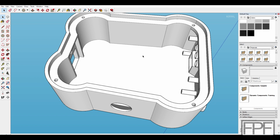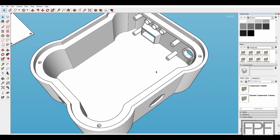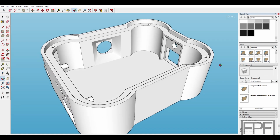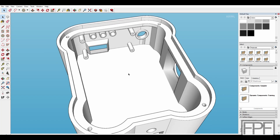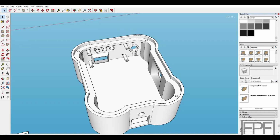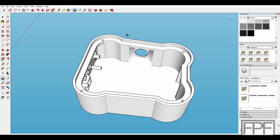I don't have room to wire in a wall wart or something like that for an AC adapter to get us down to the 12 volts DC, especially when you consider the space we're going to lose to wiring in the switch, wiring in the outlet back here, the power cord coming in through that cable gland, and all of the wiring up here. We're not going to have a ton of room left over in here. So I need to find something really small to get us that 12 volts DC to feed the timer board. I'm not sure exactly how I'm going to do that yet, but there should be room in here somewhere.